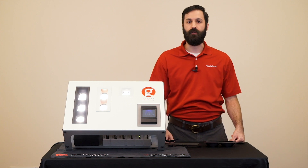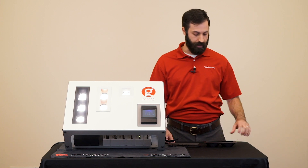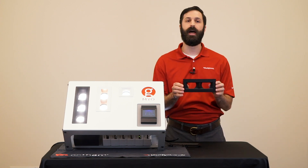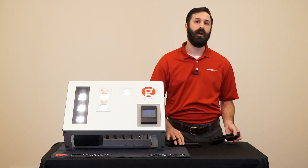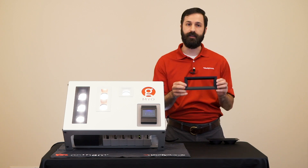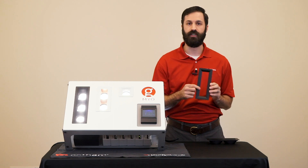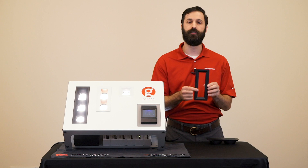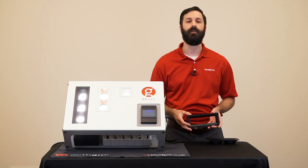In addition to the baffles, Myo has a selection of trims. The trims come in either black or white standard, and there are two different styles available. This slot trim represents a sleek, flat, linear shape that creates the most minimalist look in the ceiling. We also have a beveled trim — the luminous aperture is the same between both options, but the inside edge of the beveled trim is angled to minimize beam clipping as much as possible, especially when the heads are aimed at high angles. The beveled trim is also available in a flange-less version, which ships with a mud ring that allows it to be seamlessly installed into drywall applications.